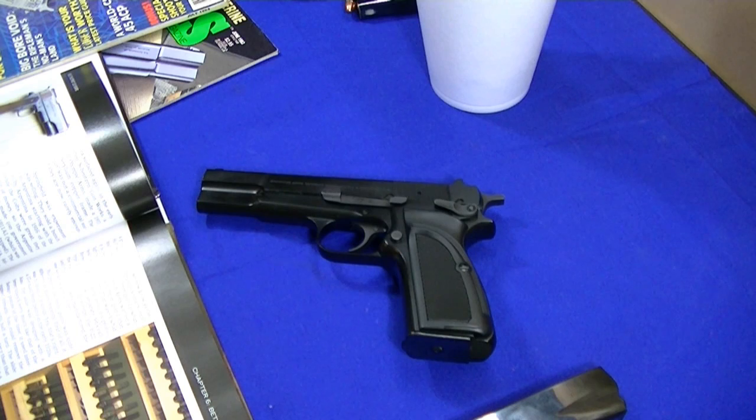As a self-contained unit, the hammer and sear parts are not subject to home gunsmithing, but as a sub-assembly, it also lends itself to precision manufacture. Once you've gotten the sear and hammer surfaces properly stoned or machined, they get assembled with perfectly fitted pins. Also, in a military or law enforcement environment, you can have a prepped trigger breech block assembly ready to go. Problem with the trigger pull on a particular pistol? Slap in a new breech block, and test. It solves the problem. Ship the old breech assembly back to the unit armorer for service.